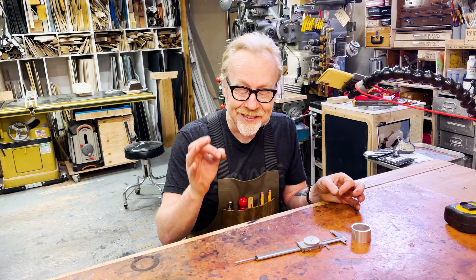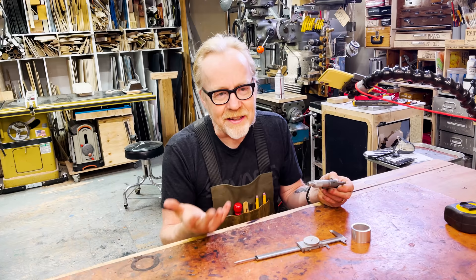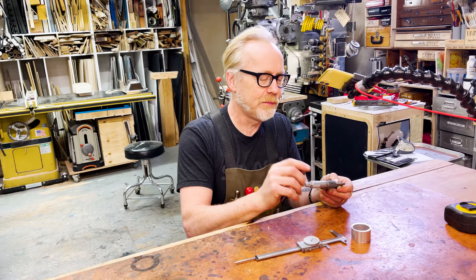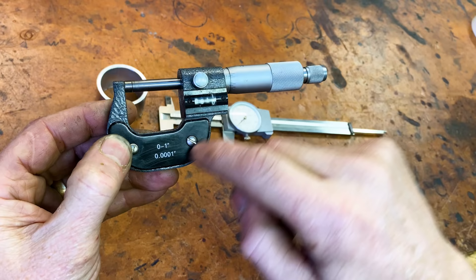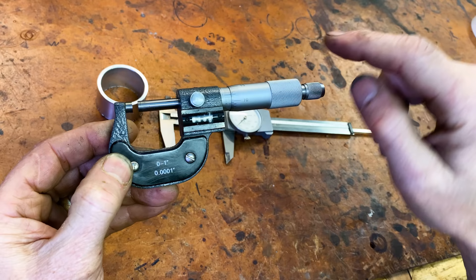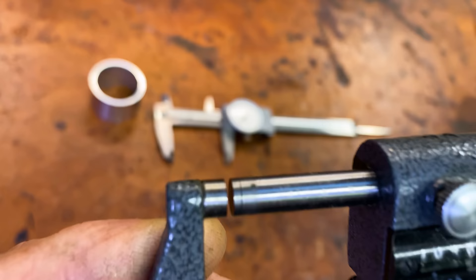And that's where this comes in. This is frequently called a micrometer — it's an outside micrometer — and it is composed of this yoke here, these two hardened steel posts, and a barrel with some measuring increments on it. It also has what's called a ratchet stop. So when you bring this thing to zero, closing its jaws, when it does it starts to click — that is called a ratchet stop.